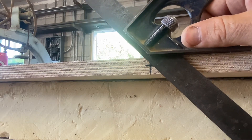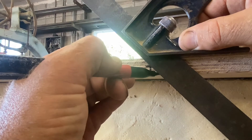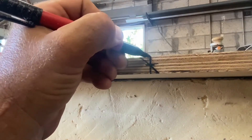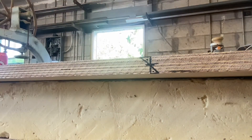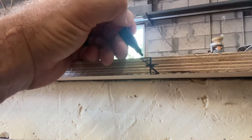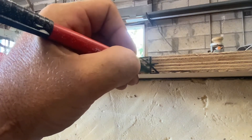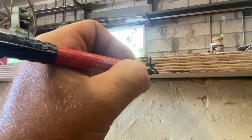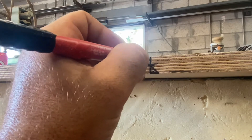We're going to flip our square over to the 45 degree angle side and put it right there where it intersects with that halfway mark, and we're going to strike a line. As you can see, we've now created two equal triangles — here and here. You'll notice a few things about them. Since they're equal, we've got three eighths here and three eighths here. That means, through laws of geometry, that this side and this side are also three eighths. We don't have to figure out what the hypotenuses are at all.